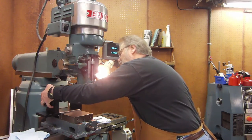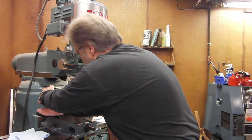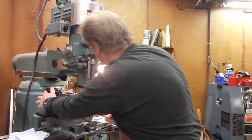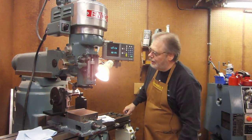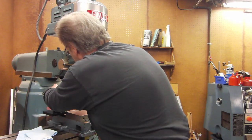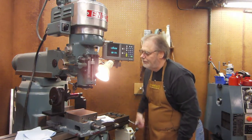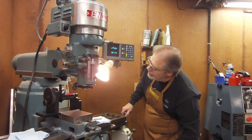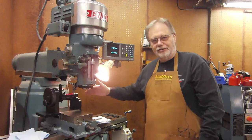And I know that it's low over here. So I want to set this to 0 on the dial indicator, and then I want to see how it runs. It's running about 7 thousandths there, and then I want to run all the way down to the top. It's gone up another thousandth to about 8, and then roll it back so it's like plus 2.5, and if we come down to the end here, it should come down real close. It's showing about 1 because I don't think that I had it centered up after I bumped it.